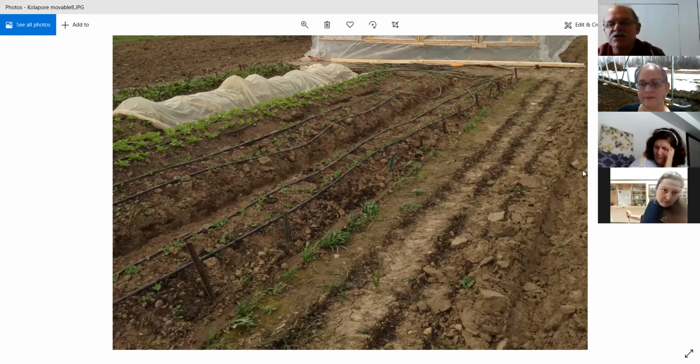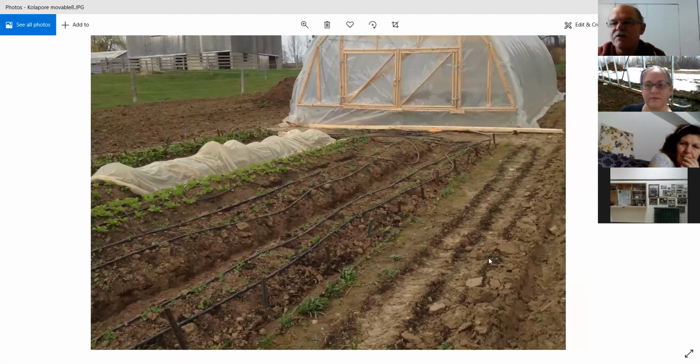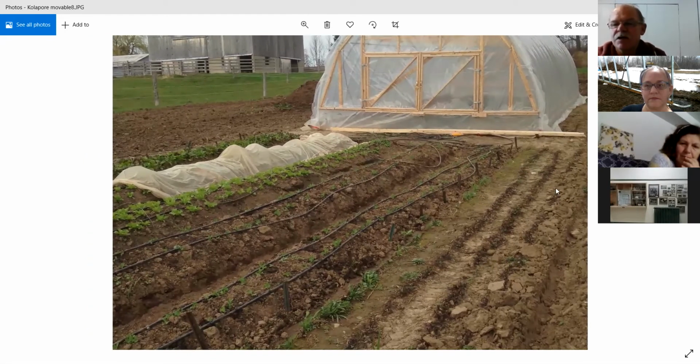We're going to get into more detail of the actual anchor post variations in the subsequent presentation. But I just wanted to draw your attention to that now, that anchoring and all the different things that anchoring involves is even more crucial when you're dealing with a movable structure, because when you've released the structure and you're committed to moving it, the structure is in a very vulnerable state. So you better have everything worked out in your mind as to how that's going to go.